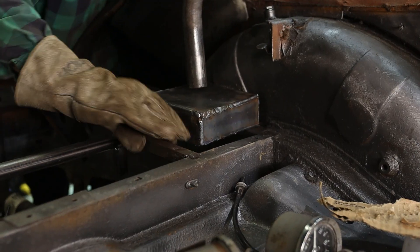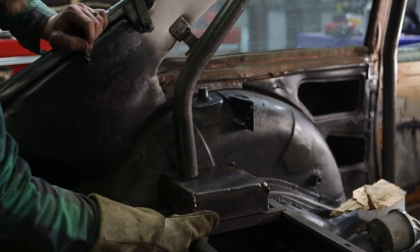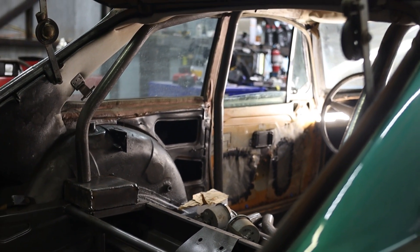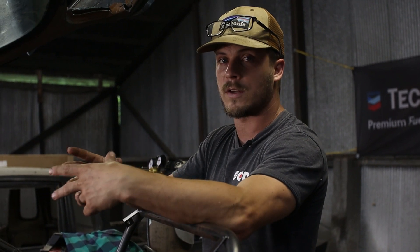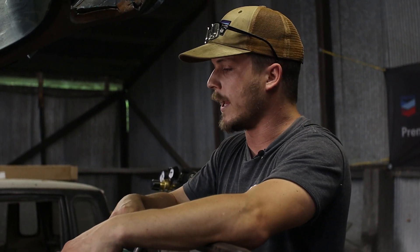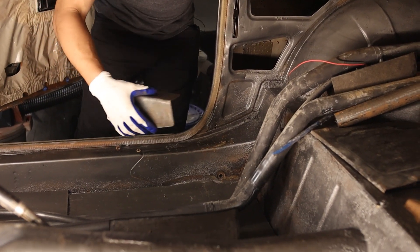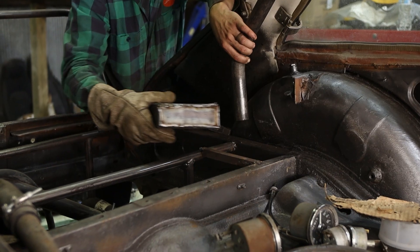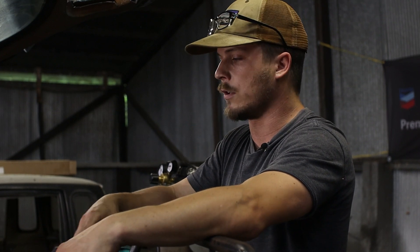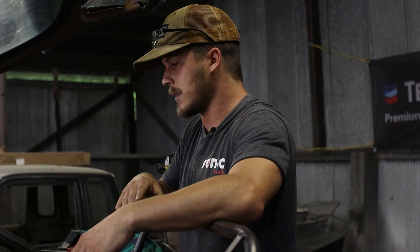I really like this a lot. Whenever you build a roll cage, you have to put it on plates — it makes the footprint of the bar a lot stronger and wider. If the car rolls over, it's pushing down on that six-inch plate rather than just the circumference of the inch-and-a-half tube. We're not building this cage to any spec because there's no racing class it's going into — this is all experimentation and education. So I got six-inch by six-inch, eighth-inch thick plates made by Foothills Fab. Shout out to Taylor — he's got a CNC plasma and knocked those out. In the front we formed them to the frame rails, and in the back we built boxes to sit our rear supports on. I think my welding is getting better.